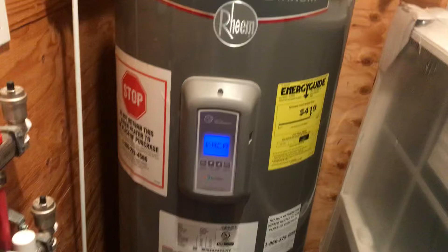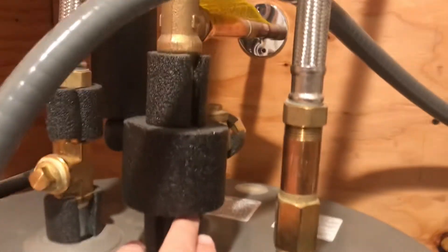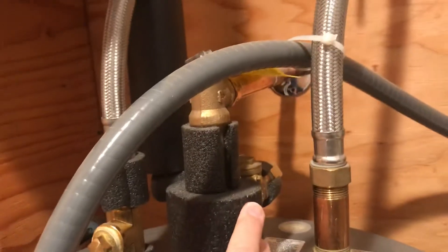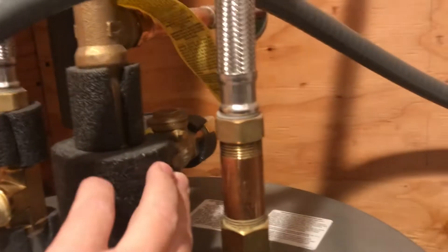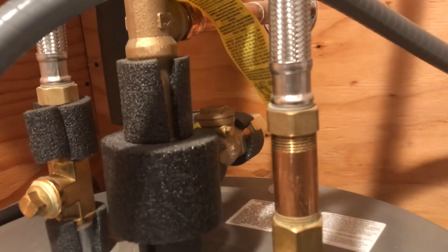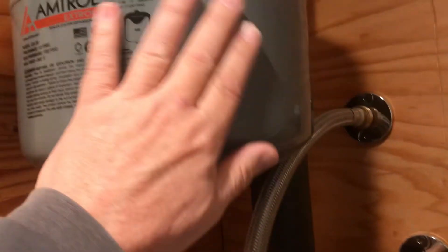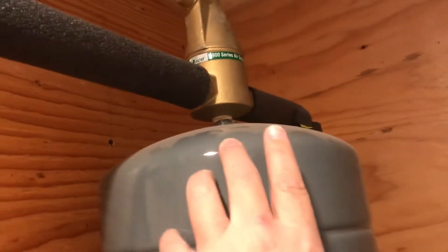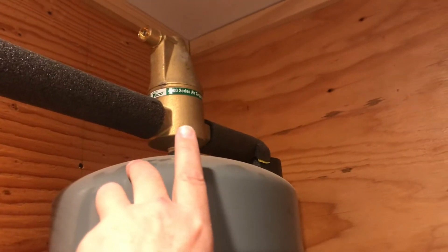Starting up at the water heater — this is a basic residential water heater that works fine. We had to allow water to recirculate, so we took off the original pop-off valve that was mounted on top, put in a T, reassembled it, and plumbed it to the outside so we're still compliant with the pop-off valve. The first component is a backflow preventer — a check valve — with water pushed in from the bottom by the pump and out through the top. Following the line up, we added an expansion tank and an air bleeder line to remove any air that gets into the system, including air that can form when heating the water.